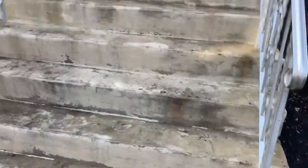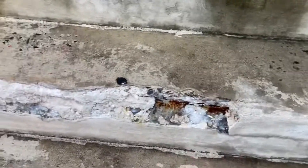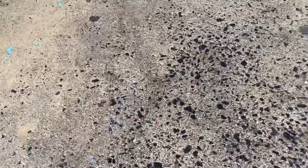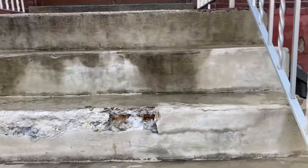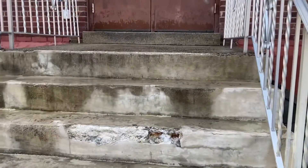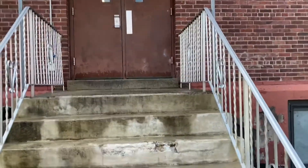On to the next steps — here's a before. This was overlaid with rapid set mortar mix 12 months ago. I wet it down. The only spot that had a problem is this crack right here. I'm gonna overlay — this is what it looked like last year, all this exposed aggregate — so we're gonna hit this top with a nice thin layer and see how it comes out. Mix that a little bit thicker to fix that crack, and everything else is going to get sponge floated.